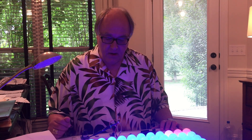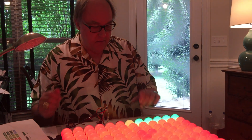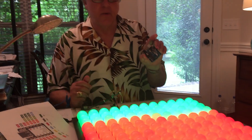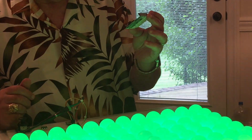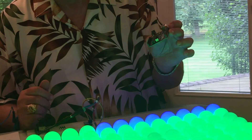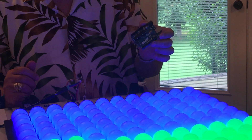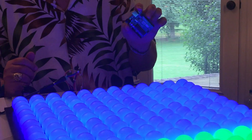Hi there. I've been receiving a few emails asking me questions about the processor I'm using to drive my 12x12 ping-pong ball array. A few years ago I would have used the Arduino Uno. It's a great little board but it's only an 8-bit processor running at 16 megahertz, and it's only got 32k of flash and 2k of RAM.